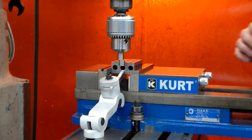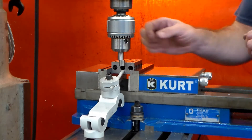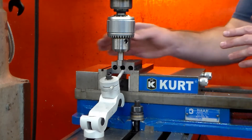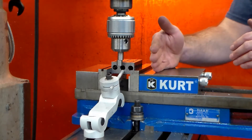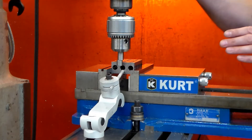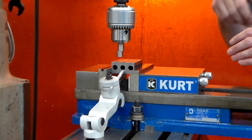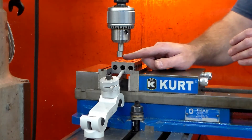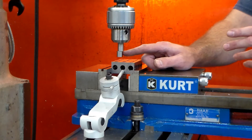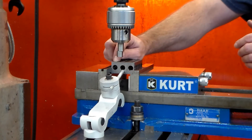I'm set at about 1000 RPMs. I'm going to turn on the spindle and then slowly move the table on the X axis. What you're going to see is the contact point become increasingly concentric and then jump off center. As soon as it jumps off center, I stop the table motion and zero out the readout. Then I lift the edge finder above the part, shut off the spindle, and move the table half of the diameter — in this instance, .250. If I was using a .200 contact tip, I would move it .100. That aligns the centerline of the spindle directly over the edge that you just edge found.